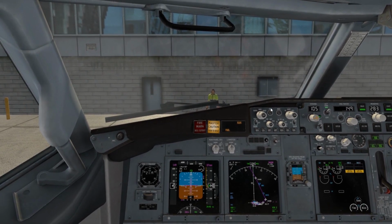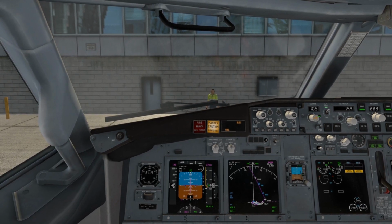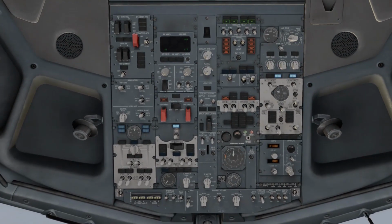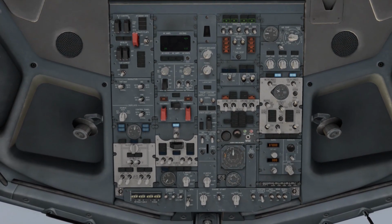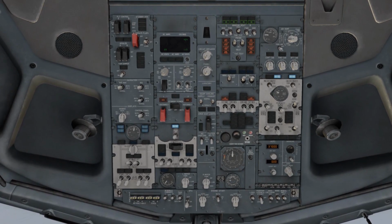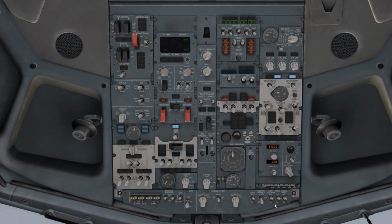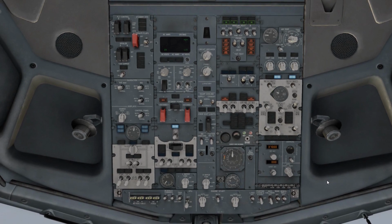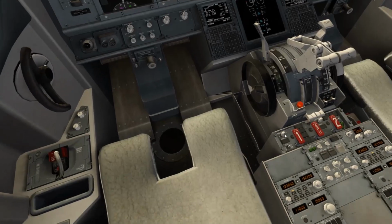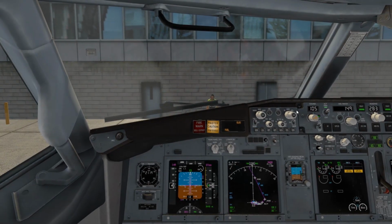So, flight plan is filed, fuel is loaded, payload is loaded, battery guard is closed, standby power guard is closed. Left center fuel pump as needed, we don't need that. The other fuel pumps are on, APU is started, APU gen is on, position light is steady. I'm going to go ahead and get the anti-collision light turned on now since we're about to move. Let everybody know. Tow connected and bypass pin inserted. Release parking brake. Alright, we're going to release that parking brake. Get the pushback started. And you may start engines.